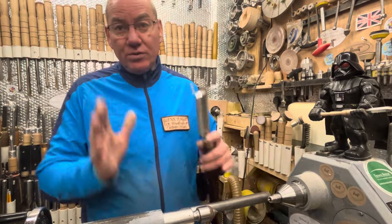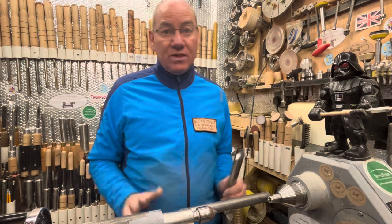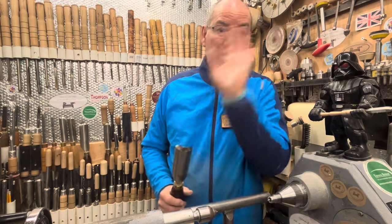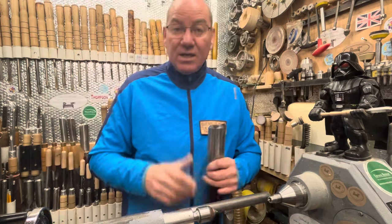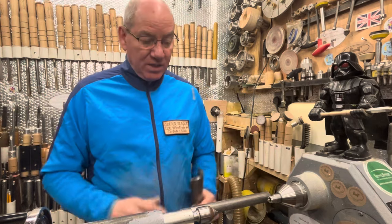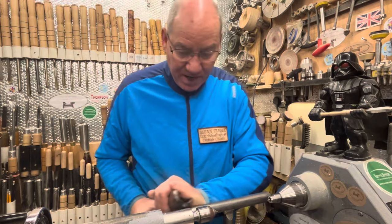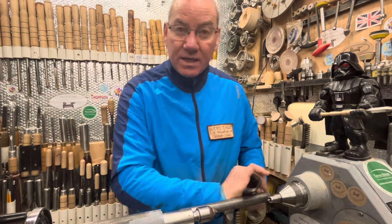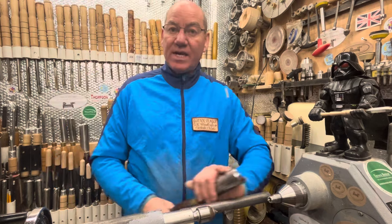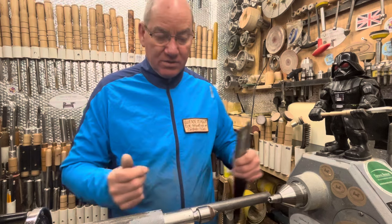Any cut you make, when you're new to turning, and I say this to everyone, if you're new to turning, fantastic. If you've been turning for 10, 15 years, and you've always been right-handed, forget it, don't try old dogs, new tricks. You should have learned a long time ago. When you're new turners, fantastic. If you're right-handed, make your cut with the roughing gouge, then stop, turn around, do it in that hand. If you do it straight away, don't come out one day and think, I'll try left-handed. This hand can always copy that hand, okay?